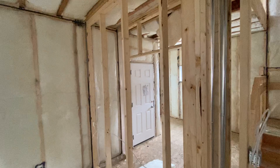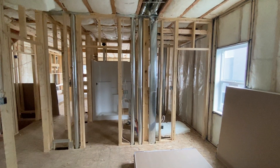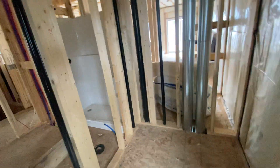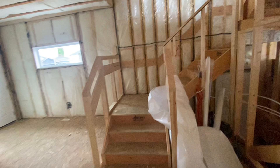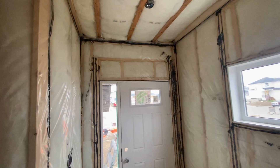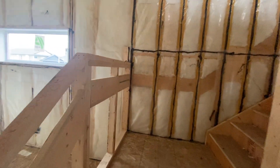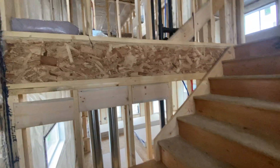This is the bedroom on the main floor. Inside that wall going into the bathroom and the walk-in closet, there is a lot of venting running, so if we're going to screw anything into that wall we need to be really careful. In the walk-in closet they did this little drop ceiling. There's a little bit of header above the doors. Going upstairs, we've got backing at this height — just two-by-six backing all the way up for the handrail on that side.